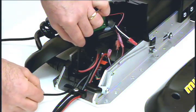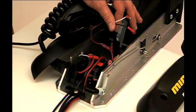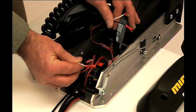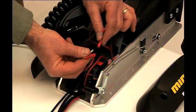The cable should slide freely when properly installed. Locate the black and white wires coming through the center housing. Now find the black and white wires coming from the iPilot steering cable — this is the cable that we just routed through the strain relief. Plug the connectors together.